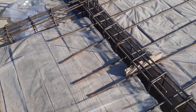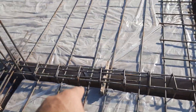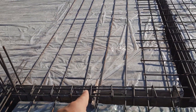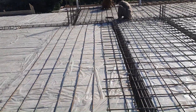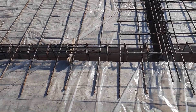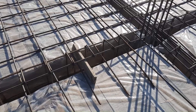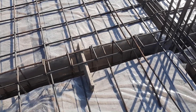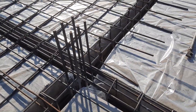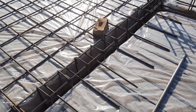As you can see, this is the beam — they placed the steel rods here, and they will connect the other steel rods overlapping with this lapping, which is not okay. The spacing of main bars and distribution bars is 9 by 9 inches. I don't want to tell them to change these things since I'm just showing you — if you are working on a construction site, do not follow this kind of construction.